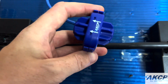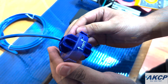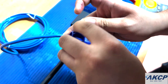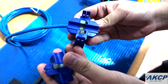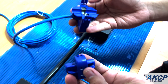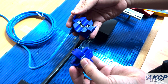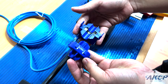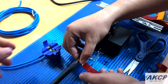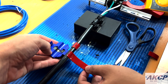We're going to open up the CCM and show you the calibration procedure and how you attach it to the cable. There are clips on either side that you pull to the side and it will open up. The next step is to clamp it onto the cable and place the tape provided on the cable so you can match the thickness and get a tight fit. You should put on two rounds of tape to align with both sides of the CCM.